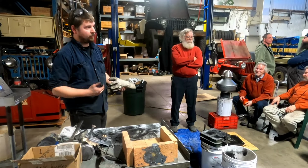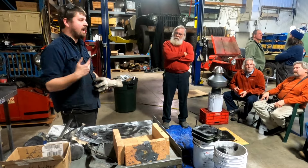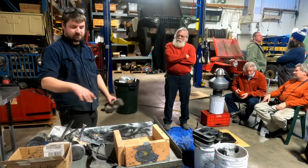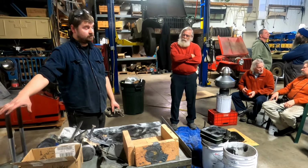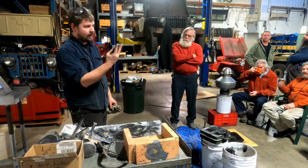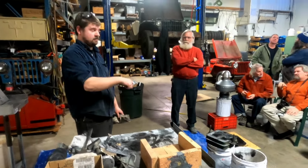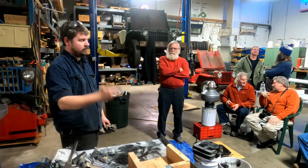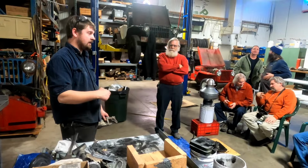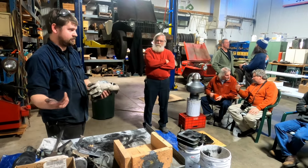Or I need to pour heavy enough parts that so much metal is going out the door that I'm constantly having to add new in and it doesn't get old enough. So this being a light part and the shift fork being a relatively heavy part, I'm gonna run 3-on shift forks. I will burn enough metal off when I do that that I'm gonna have to add in at a rate fast enough that the chemistry will always be expected. If I do a lot of belt buckles, I'm gonna have to worry about my chemistry and I'm not gonna be able to use enough returns.